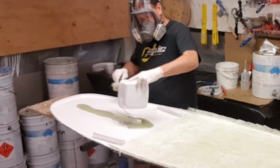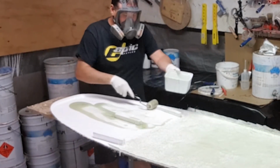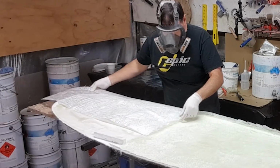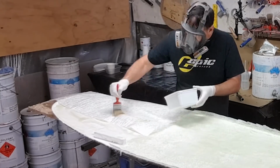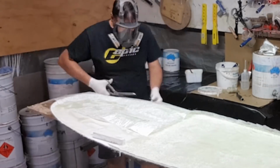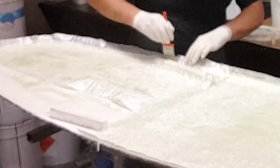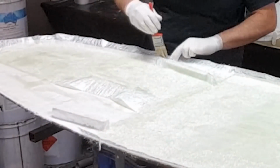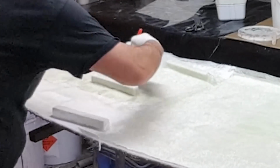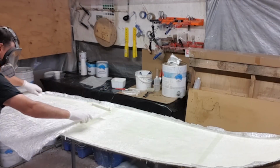The stern of the boat around the fin boxes is a challenge. I'll apply resin to the hull, and anywhere you've got a raised item like a fin box, leave your CSM on there for a moment, wet it out, just get it wet. Do not brush; you need to stipple with your brush rather than stroke, and then let it sit there for a minute and let the styrene in the resin break down the bonding agent within the fibres, and it ultimately will almost take shape on its own without you having to do too much. But it does require a little bit of brushwork around areas such as fin boxes as well.